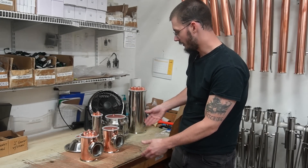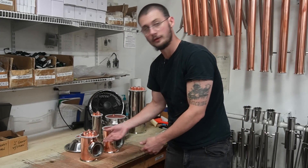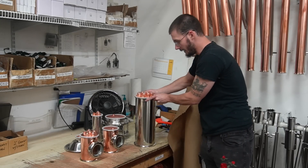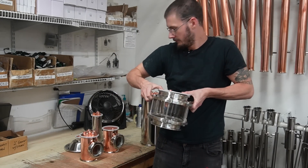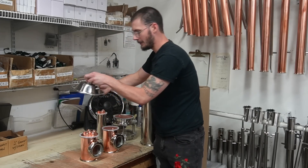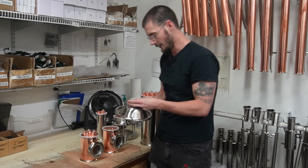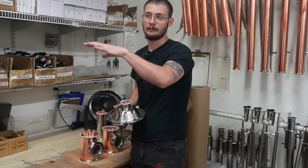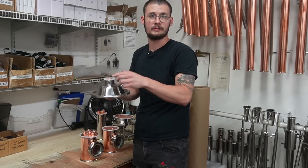These are practical mainly in reflux environments, but you can throw one in to clean something up in a pot still too. You can fit these just about anywhere. The most common way is in flute sections for pseudo-commercial stills, but right here I have it in just a regular pipe extension, here it's in a sight glass, and here it's in an actual reflux section. You can even just put it on top of your lid. You do want to get it in at the very beginning of your run as things are coming up — you want it in pretty much right as that boil hits.